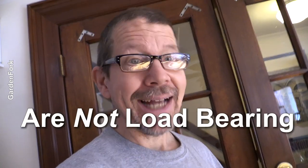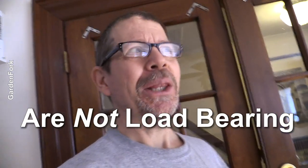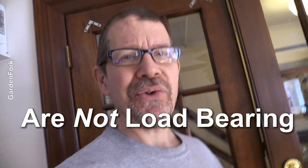whenever you've seen anything with drywall screws, red flag, okay? Drywall screws cannot carry weight. They can't carry a load. They're cheap screws that are meant to hold drywall against a piece of wood, okay? Not a door from sagging.